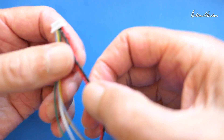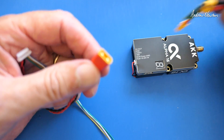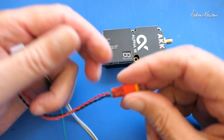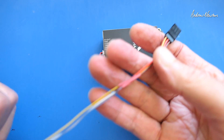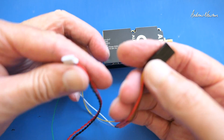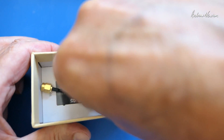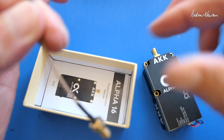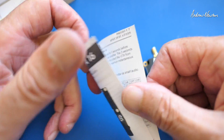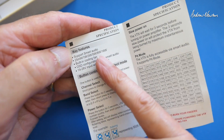It comes with a cable that plugs in, with dual twisted power cables. I've soldered on an XT30 so I can power it from my two 3S batteries. The green wire is smart audio, which I don't need or can't use, and then we have 5 volts, ground and signal for the camera. The power levels are 25 milliwatts, 1 watt, 3 watts, 5 watts, 8 watts, and 16 watts. It has a cooling fan and takes 19 to 28 volts input with 5 volts output.